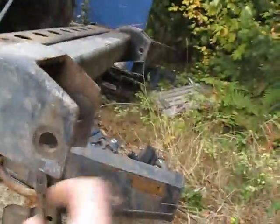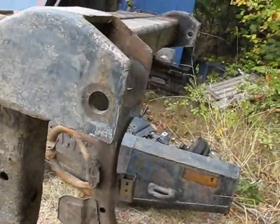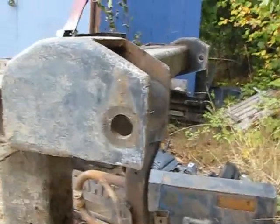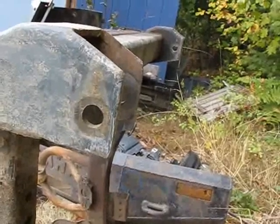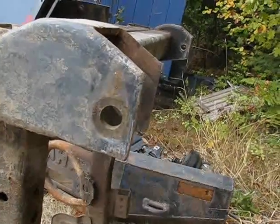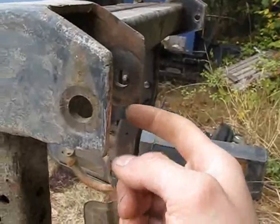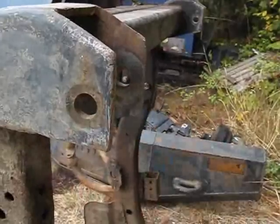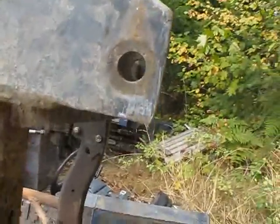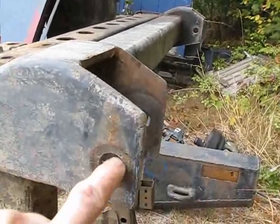So also, when you do this mod, you cannot reuse that stock leaf spring pin that they use. So all I did, I think this is an 18 mil hole. It fits 18 or I can't remember exactly what size bolt, but I did not need to reuse the spring bushings. Yeah, so it's 18 mil. So you don't need the bushing because the bushing takes a 14 mil bolt and adapts it to an 18 mil hole. So all I did was I just drilled a hole. I can't remember what size it was. It's a little bit bigger than 1/2 inch. But again, I had all these plates clamped together when I drilled the hole so that they were all perfectly straight.